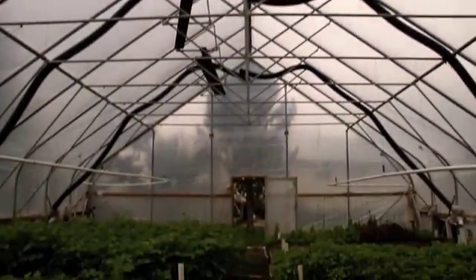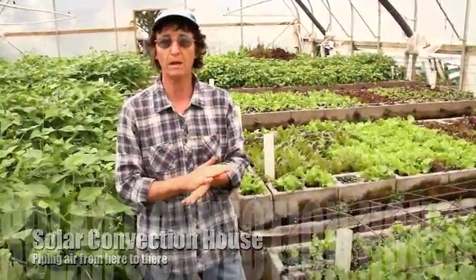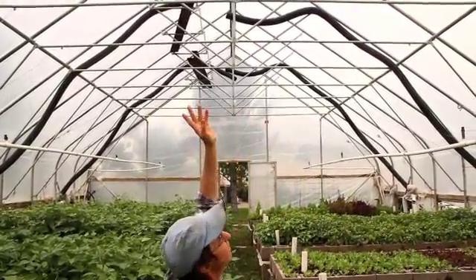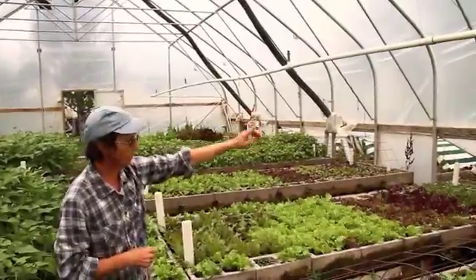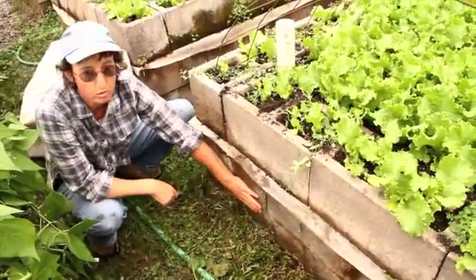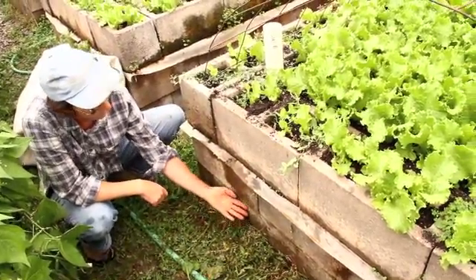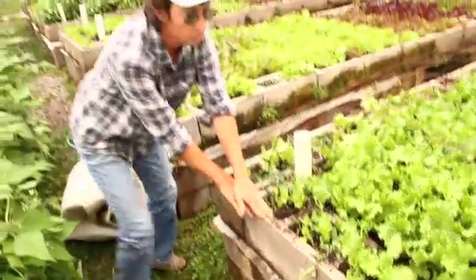This is our solar greenhouse. We got a grant from CSU to do an experiment comparing growing with solar as opposed to propane. We have pipes that suck the hot air off the ceiling. It comes down through a little blower fan in the corner and it blows the air down into these two lower layers of the bed. These are full of gravel so they absorb the heat during the day, and then at night they radiate the heat up into the soil level — above the plastic — which is where the plants grow.